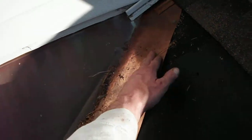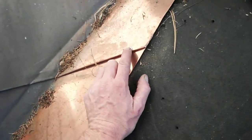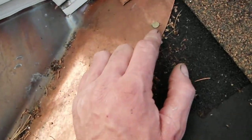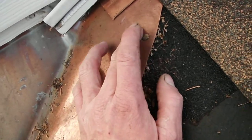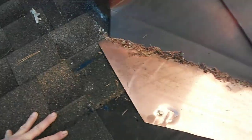We had the valley shingles out and the first thing that jumps out to me is the width of the copper where it crosses the valley — it should come at least 14 inches, 12 at the minimum. You should also never nail within six inches of a valley. What you see here is a zip screw and a regular roofing nail, which is not good with copper — if it ever gets moist it'll produce an electric current and erode it.